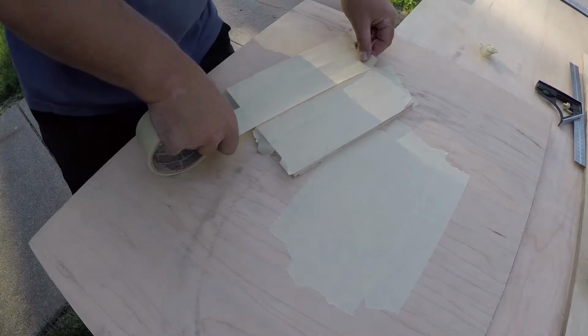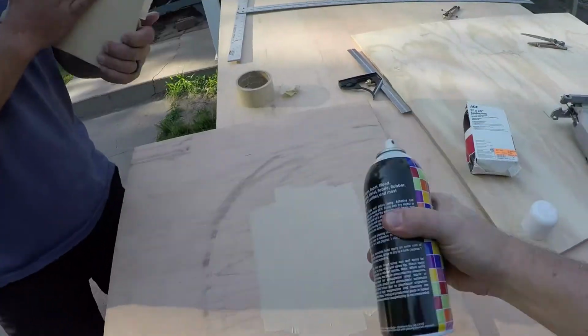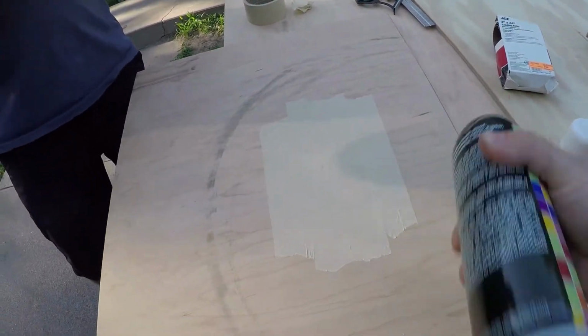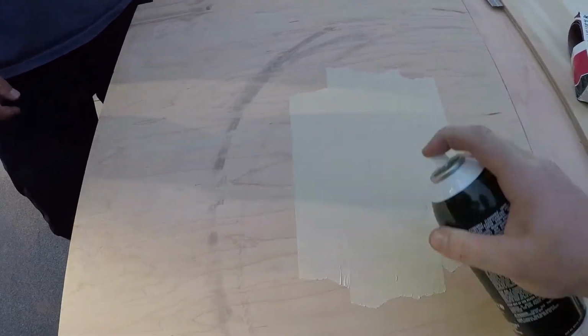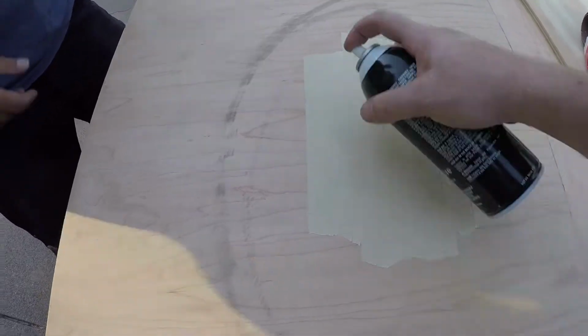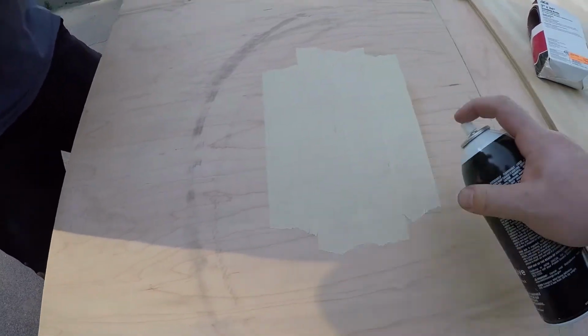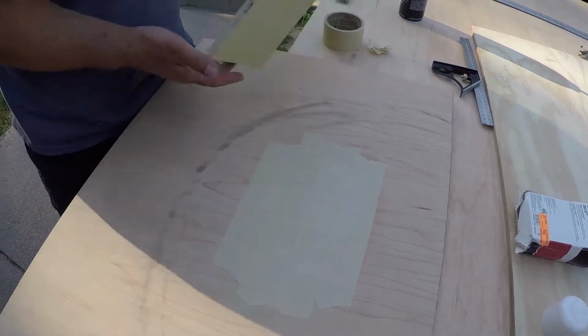Nice. So, having tested this successfully, it was time to just tape off the back side of the pieces so that we could use a little spray adhesive, stick them together, and that way we could have both the plug for the top and the hole in the deck for the fuel filler cut on the scroll saw in the same operation. All right. Oh yeah, that's getting tacky.